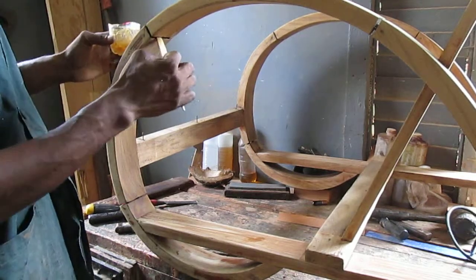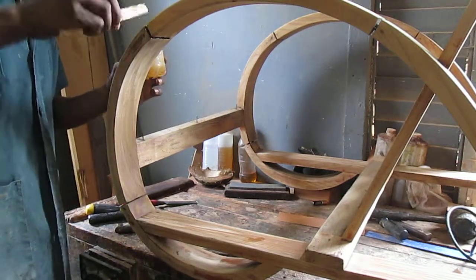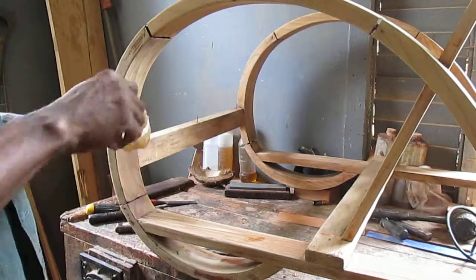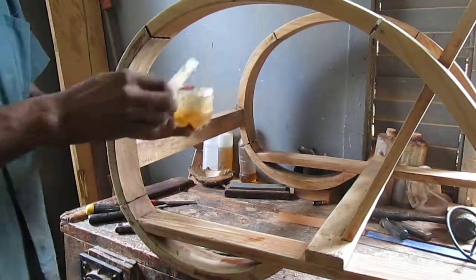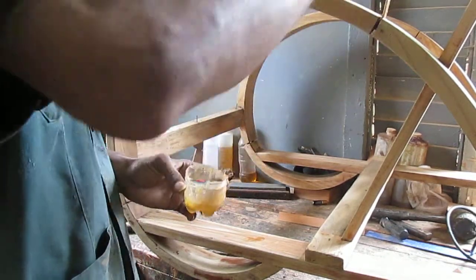You put it on both sides — it's going to get into all of the joints. If you try to dismantle the whole chair with these nails inside, all these pieces are going to fly out and you're going to have problems. So what you do is prise it open as wide as you can and put the glue down on the inside.